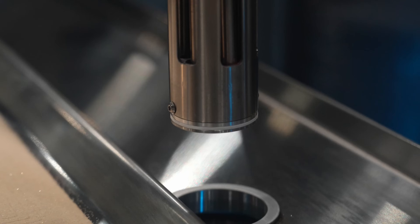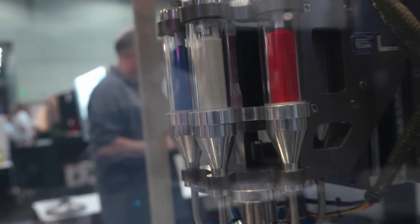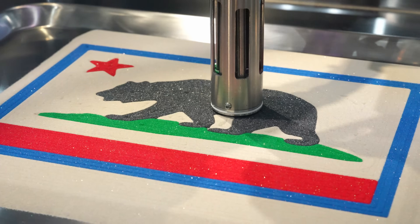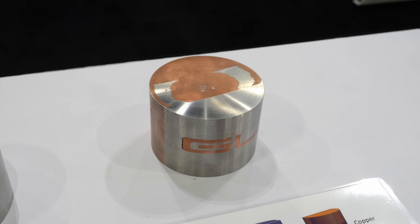And you don't have to heat or cool or deal with any of that. These are all loose powders with no binder. We print directly into a hot isostatic press. They fill up in the can. After the can's sealed and degassed, we send it to get hipped. And at temperature and pressure, the metals consolidate. And the support material stays loose.